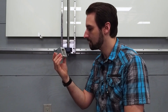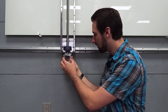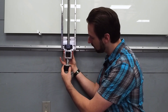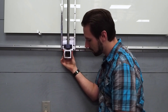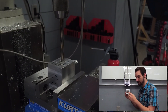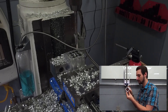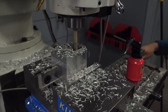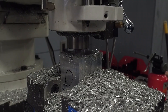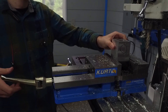The first part we're going to look at is this guy here. This is the first of the motor mounts, and it's going to go right here to allow this motor to be attached to the system. Probably the biggest part of making this part was trying to cut out this entire pocket all the way through, so I've got a big half-inch end mill, and I tried a couple of things to make it easier to cut all of this material out. I pre-drilled it, which I don't think helped as much as I was hoping it would.